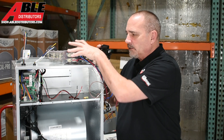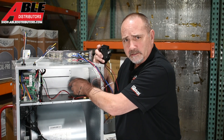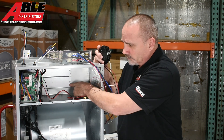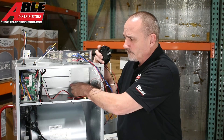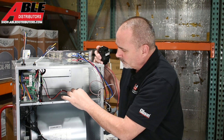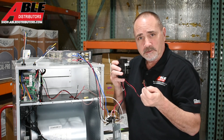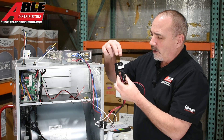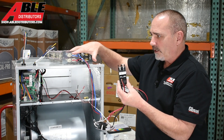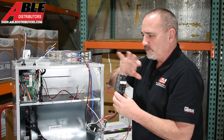If you're installing a heat kit, there's a panel in the back — actually two panels stacked. With a 10kW you remove one of those panels. The screw holes for that door panel line up right here. You'll take those two leads and wire nut them to the matching leads, so L1 and L2 come in, heavy leads power the heat, light leads go to the board. You're golden.